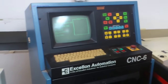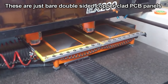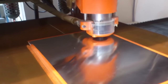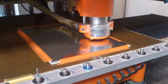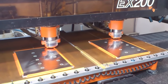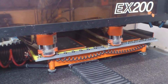But we're getting ahead of ourselves — we don't actually expose the board yet. We first drill the plated through holes. This is an Excellon brand CNC machine used to drill these holes. The Excellon file format is what a lot of PCB manufacturers specify for drill files. You'll notice the machine is picking up different sized drill bits, and there are multiple panels stacked — maybe five or so — taped down and drilled all at once. It's just more efficient to drill multiple boards simultaneously. They would also have pinned or staked those panels down so the boards don't slip and get misaligned during drilling.